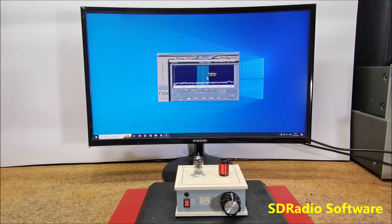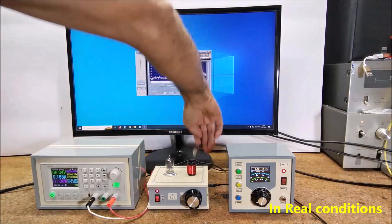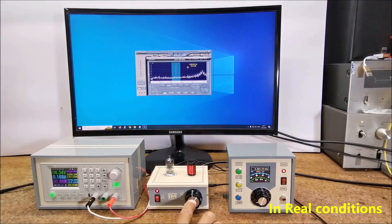The stability of the received signal frequency mostly depends on the VFO generator, which in this case is very stable and precise. That's why we can perform demodulation of several digital audio signals with different software. The receiver should first be tuned to have the best reception around the desired frequency. For this purpose we approximately set the frequency of the VFO, and without the antenna connected we turn the variable capacitor until we get the strongest reception noise.